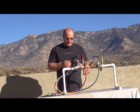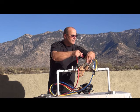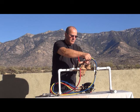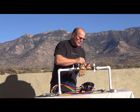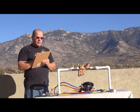Now we're going to shut it down — shut off our test cocks and disconnect our equipment. We'll turn on the number two shutoff valve to get our customer back in service. Then we fill out our paperwork: first check is 8.0, second check is closed tight, relief valve is 2.8. With the backflow assembly information pre-filled out, we have a passing RP test.